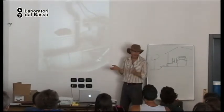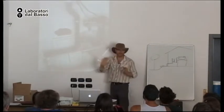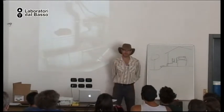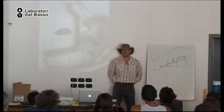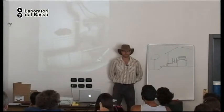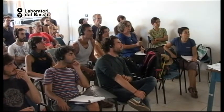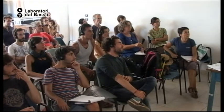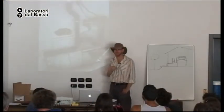Okay, it's ugly, but the house was already ugly. There was already the hole in the wall and the stains. That was already there. It's the plumbing that bothers me, the way the plumbing was done. The electrical outlet is too close to the vent, to the tube that exits. Yeah, so that's an issue. If the water backs up, it could go there. So that's one issue. But there's a bigger issue for me.